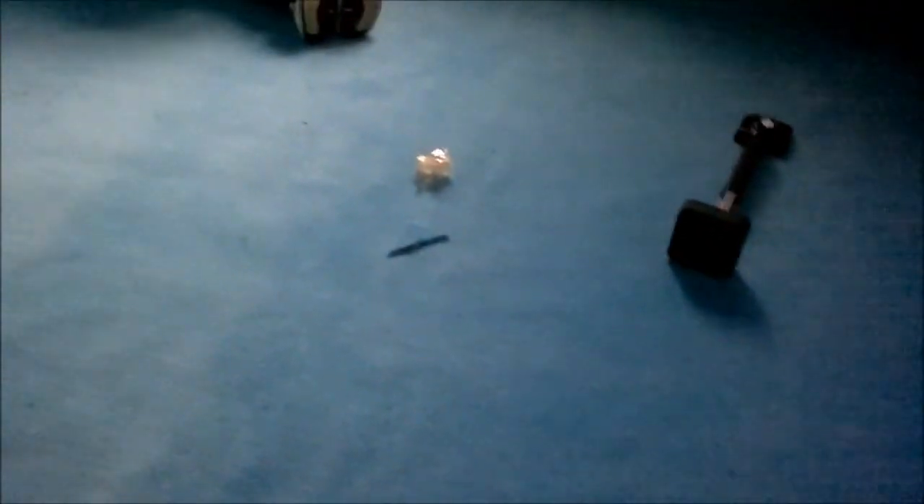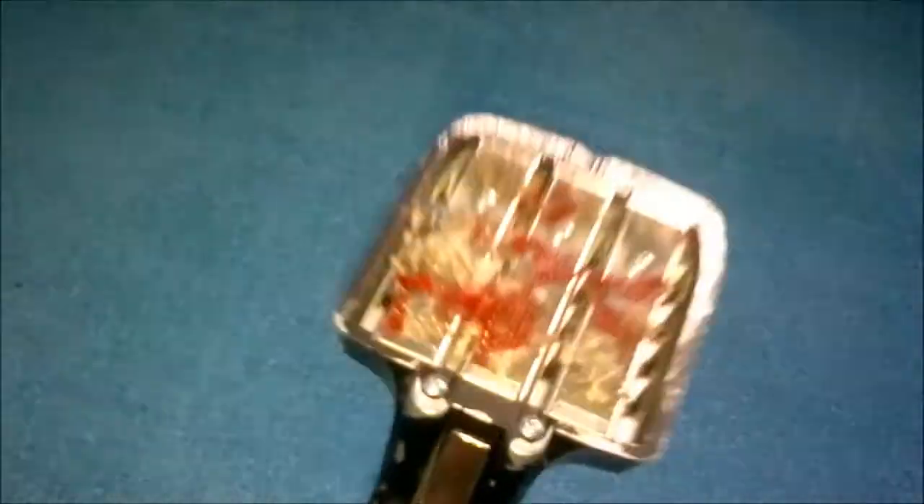Once your carpet is down, corners cut, you need your stretcher. This is your carpet stretcher — it's got teeth in it. As you put it onto the carpet and go forward, you use your knees to hit it and it pulls the carpet forward. You press down on the grippers — hit with your knees and grip.